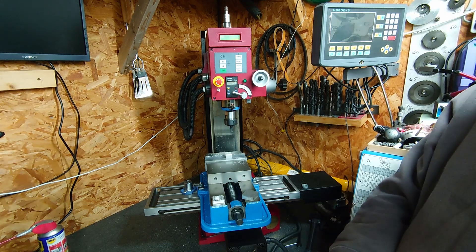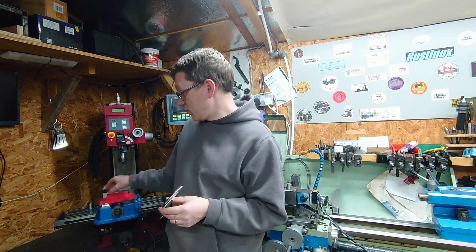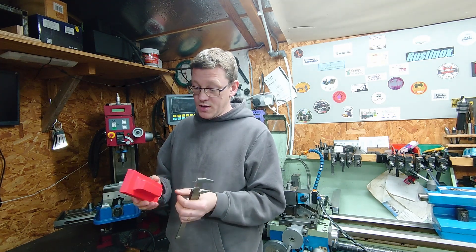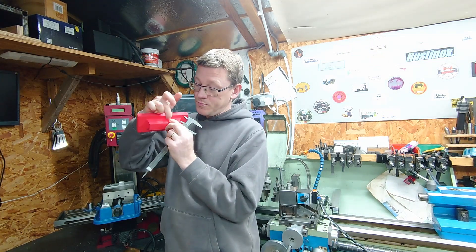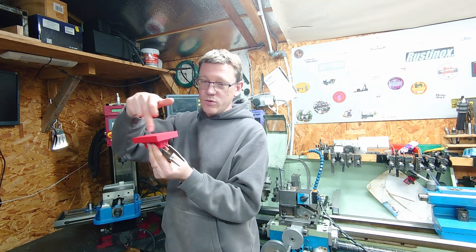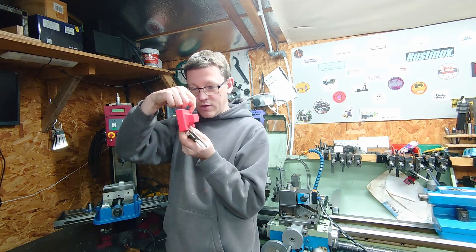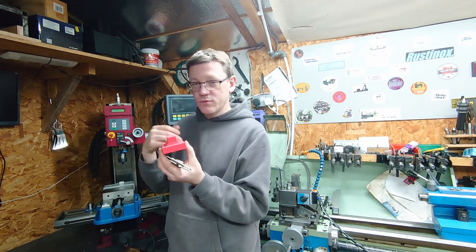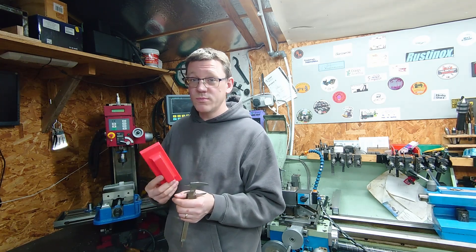Although I think I'm being pretty conservative — I think I can probably go a bit more aggressive, especially on the aluminium. So lots to play with. Now I need to make the plate itself. Unfortunately I don't have a piece of material that size, but what I do have is a 3D printer, so I've made up a pattern and I'm going to cast a lump. I've cast in a section that I can grip in the vice with a little step so it will sit above the vice, and then I can machine around it, do the contour, do the bearing hole, drill the holes, and then I'll probably bandsaw off the lump, face it, and do the counter bores for the cap screws from this side. So the next job is to cast this — that'll be the next video. I hope you enjoyed this one, thanks for watching.